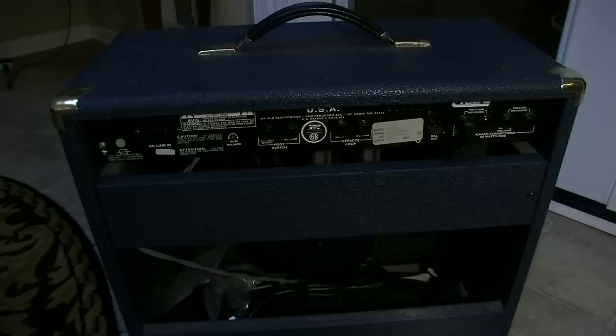Well, yeah, in a way. But I'm also dialing things up on a Variac to make sure that there's no dead shorts or anything like that before I try something like that. And a lot of times it'll be really instructive to fire an amp up in situ and try to see exactly what it's doing and what the customer might have experienced before you go yanking the chassis out. Because sometimes it might be something as simple as a bad connection to a speaker or something like that. Anymore, I like to see what it's doing, test it out before I just rip into the thing. So let's do that first. We'll test it out, see if we can recreate the problem, and then we'll go from there.